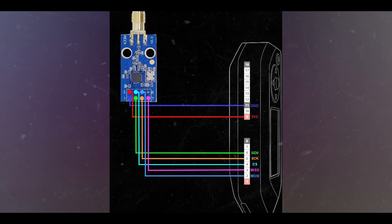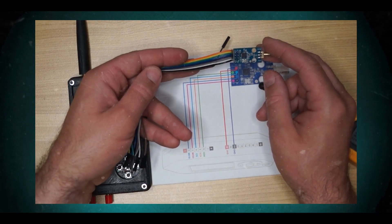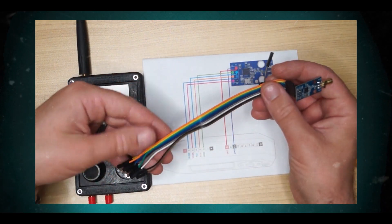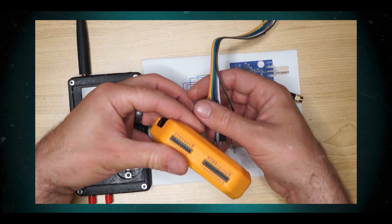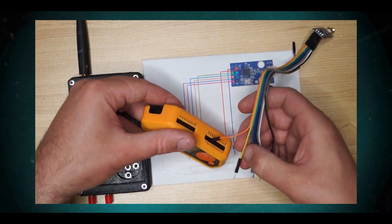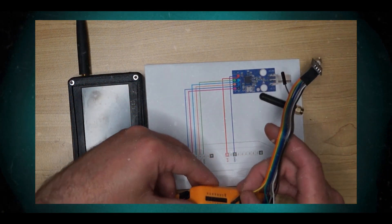The digital features include flexible support for packet-oriented systems, on-chip support for sync word detection, address check, flexible packet length, and automatic CRC handling. It has a programmable preamble quality indicator (PQI) for improved protection against false sync word detection in random noise. There is support for automatic clear channel assessment (CCA) before transmitting for listen-before-talk systems, per-packet link quality indication (LQI), optional automatic whitening and de-whitening of data, and a 200 nA sleep mode current consumption with a fast startup time of 240 microseconds from sleep to RX/TX mode.